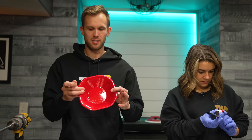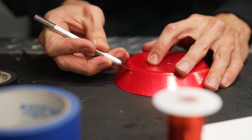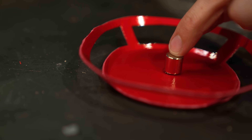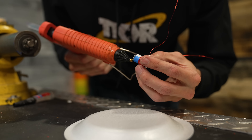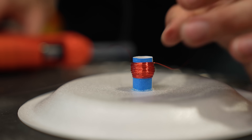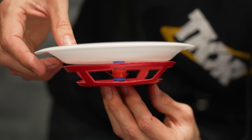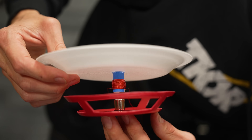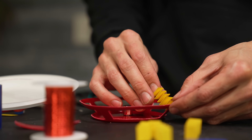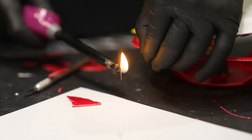I want to remove the inner layer — I don't want both paper wraps, just the one. We can make some pretty cool speaker-like shapes using these styrofoam bowls, and I'm going to try and turn this into a shape that lets our paper plate speaker cone fit nicely on top. I need to secure the magnet down in place to the bottom of the styrofoam bowl speaker body. With the magnet secured, I take our little wire wrap and secure it onto the plate that is going to be the cone that actually creates the sound. If we fit our paper cylinder over the magnet, the paper rests all the way down to the bottom — that's not quite what we want. We want to hold it up so the wire wrap just slightly overlaps the top edge of the magnet, so we're going to make some paper springs that keep our plate suspended at just the right point.